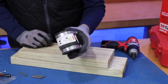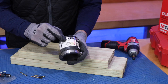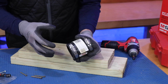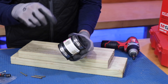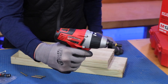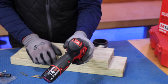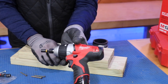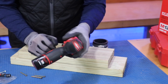I was going through my tool cabinet and found a two-inch Fernco Plum Quick adapter. Step three says to torque it to 60 inch-pounds. There have been times I've just used a wrench to tighten a Fernco adapter — like on a sump pump — and then plugged it in and saw water jetting out the side. So it's important to get the torque right, and that's where this tool comes in handy. This tool is proven accurate for up to 25,000 clamps, after which a light comes on indicating it needs recalibration. You can send it to Milwaukee and they'll recalibrate it, then you're good for another 25,000.